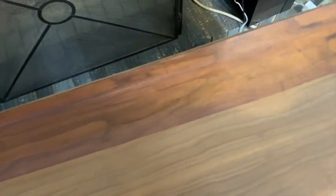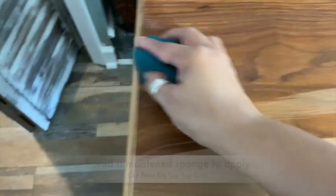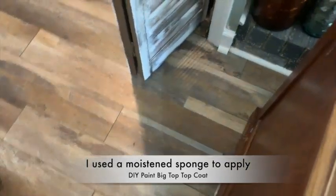After many microfiber cloths, I was finally ready to paint. The original plan for the top was to use Dark and Decrepit — it's my preferred stain. But once we realized how red the wood was, I wasn't sure what the actual finish would turn out like. So she decided she kind of liked it natural. We tested it and I put Big Top on there — just one coat at first — and she loved it. I used a moistened brush, which is my preferred way of using Big Top. You don't want to overbrush it, just go one stroke at a time, let it dry, then apply your other coats.